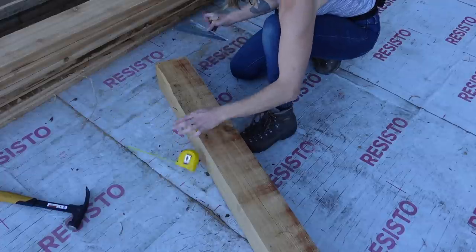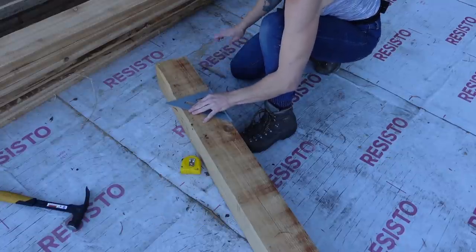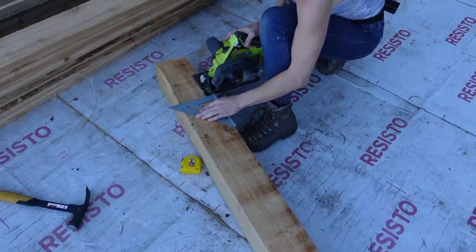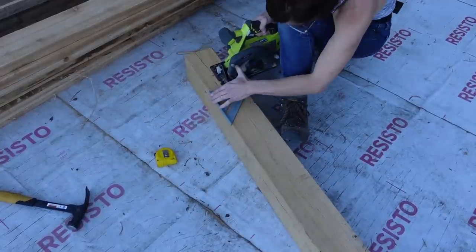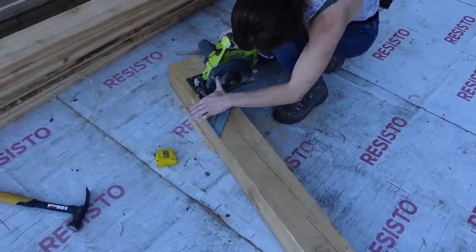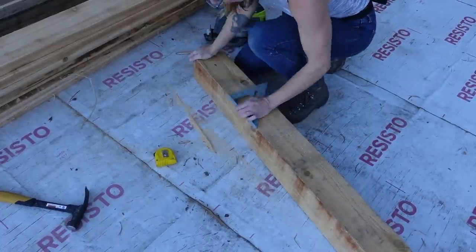So I think I'm going to end up doing less. I was going to make them a foot long, but I'll make them shorter so that I can stay within my roof material, if that makes sense. And then adding fascia on each, probably front and back, maybe 3/4 of an inch each, so an inch and a half extra. I'm thinking about all these things I have to take into account. That's going to play a role in what length I use for these little false rafter beams.